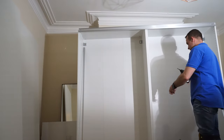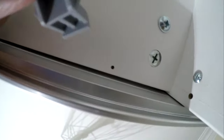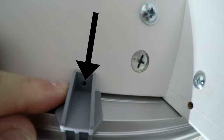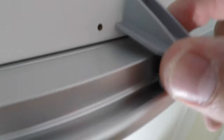Now we're going to do the inner side - securing the rail from inside. We'll have 8 of these inner plastics, 4 in each panel. The holes are pre-drilled already. Put the plastic into the frame from inside and find the holes - there is a pre-drilled hole there. Go through the plastic into the hole and do exactly the same on all 8. Make sure you go inside - if you stay outside it's going to be useless. Place the plastic in, find the hole, and sometimes you have to push the plastic slightly harder in. It's important you go right on the top of the hole and place the screw in.